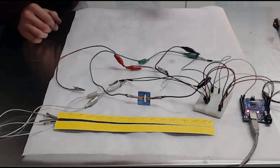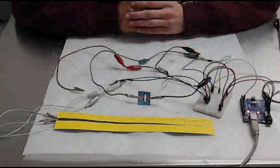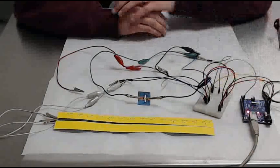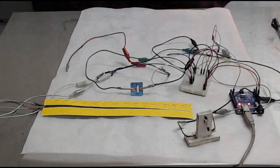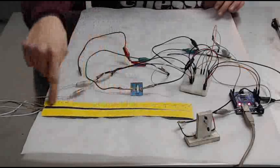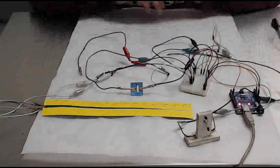So that is absolutely fantastic. And it's not only that we can do this with LEDs — we can also do this with motors as well. So to do it with a motor, all I have to do is wire it up before the resistor in this breadboard. We've wired up the motor into the breadboard now, and it should work exactly the same as the LED. Depending on where I touch this lead right here on this potentiometer, it will change the speed of the motor.